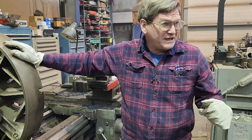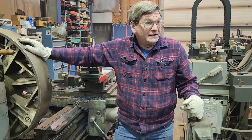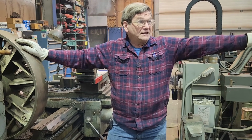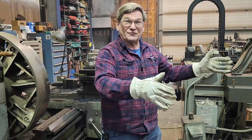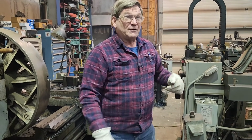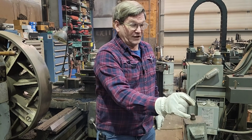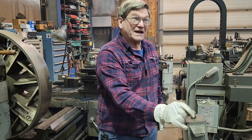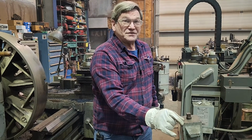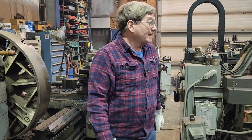When I was doing field machining, we did a field cutting where we cut 2,200 feet of plate with a machine that we built that clamped onto some rails and traveled along, had hydraulic drive, and we were milling out 7/8 inch wide by 1/2 inch deep. And I think we were around 6 inches a minute or so for our actual travel. It made fairly good time.